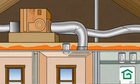We talk a lot about air sealing and how important it is. Today I'd like to focus in on one area that causes a lot of trouble, and that's recessed lighting. Recessed lights, also called can lights or high hats or eyeballs, come in a variety of shapes and styles, different trims, etc. They're mounted up in a ceiling and have a very clean flush profile, so they look great. The challenge is the way these are installed in your ceiling — they create huge bypasses for air.